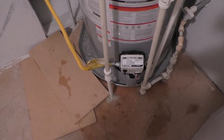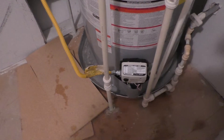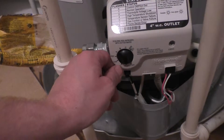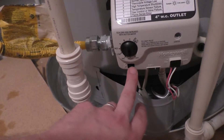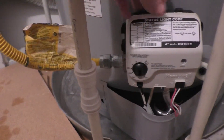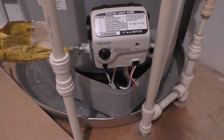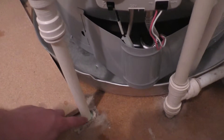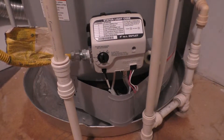This is a little bit different than my last hot water heater so I had to read the instructions. It's similar in that you have an off/pilot/on setting and you push the knob in to allow gas to go to the pilot light, with an igniter and heat settings up top. It's nice to have everything on one knob instead of a separate gas control valve and separate temperature control. And we have success — that was relatively easy.